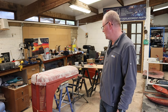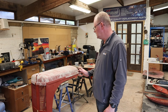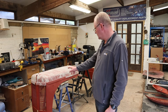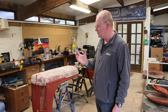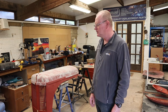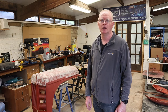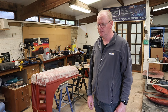In the meantime I'm going to carry on with this bonnet. You can see I've put some filler on it — I've done an initial filling, but I ran out of filler so along this bottom edge I've still got a little bit more to do. Until I get some more, I'm just going to start sanding this and see what sort of finish we get. I'm pretty certain I'll have to do a second pass with the filler, but I thought I'd have a go today while we're waiting for the wheels to come back.